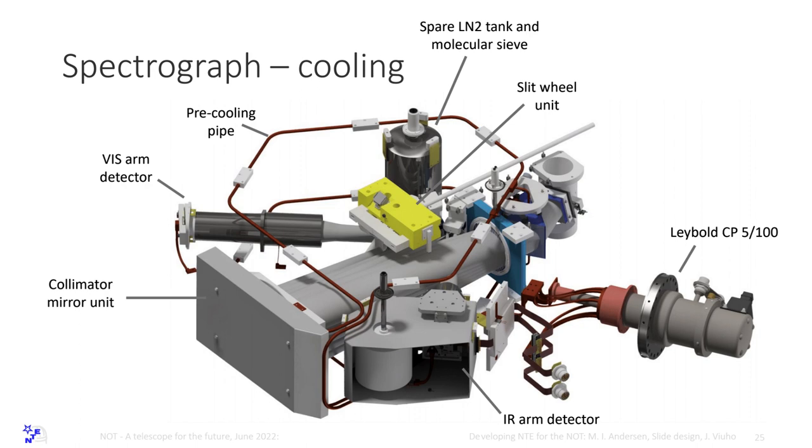So the cycle of making an adjustment in this instrument is of order 2 weeks. If we have a small error inside, it takes 2 weeks to correct it. And therefore, we have made the bench so that all the optical surfaces with mirrors are resting on three balls of a plastic material called PEEK, that is vacuum grade. And we measure all that stuff up in a coordinate measuring machine to an accuracy of about 5 micron.